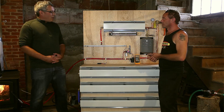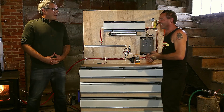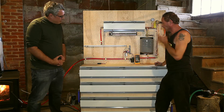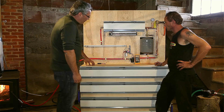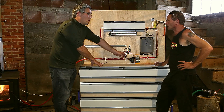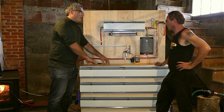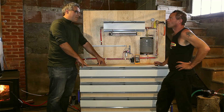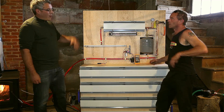You could look at it the other way and say the byproduct is actually the hot water because you're generating electricity. So what is this device right here? This device is just monitoring the voltage that is actually coming off the thermoelectric modules. We take that raw voltage and use controllers such as this pump controller to drive our pump down here. This is a 5-watt pump that has up to close to 15 feet of head pressure, so it can move quite a bit of water over quite a bit of head.